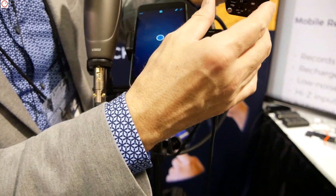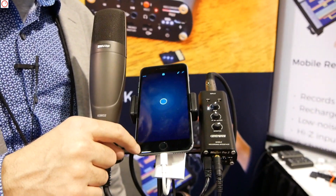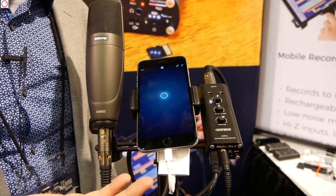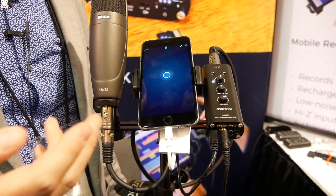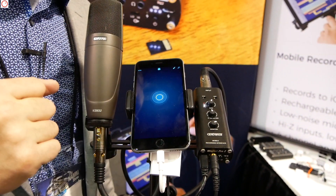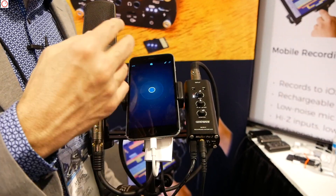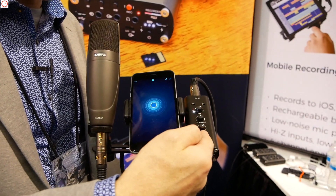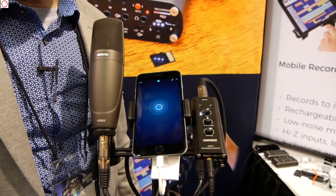And you can also record on it? Well, there are two uses for this product. Because it's got a USB audio interface, you can connect it to the phone and use the phone as an audio recorder, but you can also use the phone as a streaming device. So you can use this for Facebook Live streaming or any other kind of live streaming — you don't necessarily need to record. You can just stream live in high-quality. It's compatible with Facebook and all these apps, of course, because the phone becomes the machine that gets you online. What the phone doesn't have is a high-quality microphone. That's what the MicPort Pro adds — the ability to use a high-quality mic, which goes to a high-quality preamp, high-quality A to D converter, and then straight into the phone. This is essentially the missing link that provides the audio you need for professional production.